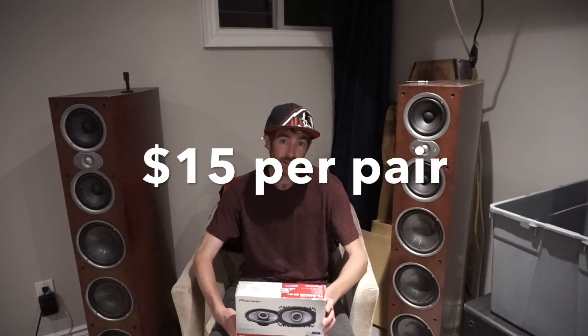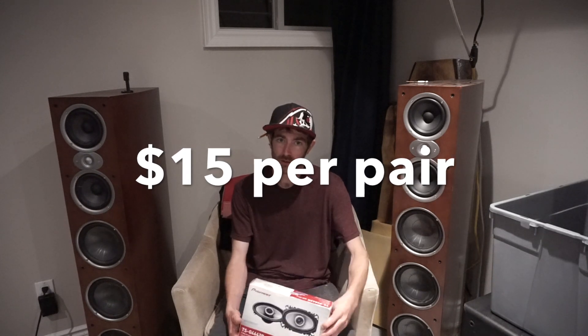So what we used for this Bluetooth speaker are two sets of Pioneer car audio speakers — these are the 4x6's and we also used these 6 inch rounds. Basically the same model, same wattage, same impedance, basically exactly the same — just these are oval and the others are round. We used a 50 watt x 2 and a 100 watt sub channel Bluetooth receiver amplifier that we got off Amazon for like 40 bucks.